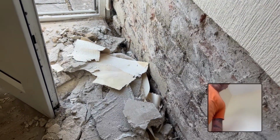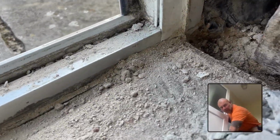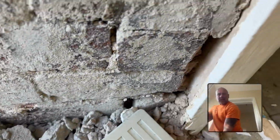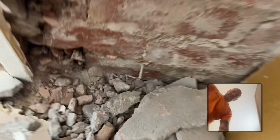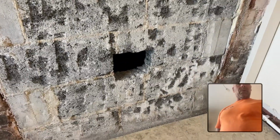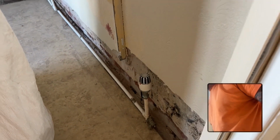And this again, there's all sorts going off. So you've got grit holes that go through, and that will just fill with gypsum plaster. You've got side casings here, again filled with gypsum plaster. Same down there. All them holes, any big holes, they've just stuffed a load of plaster in. So it don't really help. Now we've got a venting chimney. Just looking down there, there's a couple of gaps.